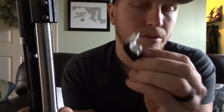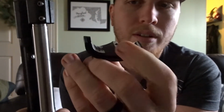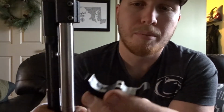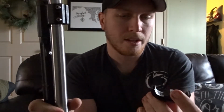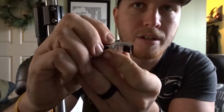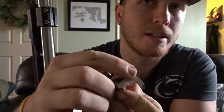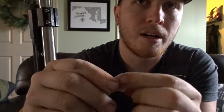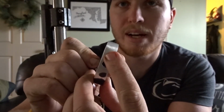This is the side the screw goes through. The other side attached here is the receiving end, and there is not a whole lot of threads left whenever they're actually clamped on, but there is enough to take the force of what we're dealing with here. You can see also there used to be a ledge right here that went around, I guess to mimic the actual retainer that was originally on the SVD. I ground that off. So these are perfectly smooth and flat in front of each other.